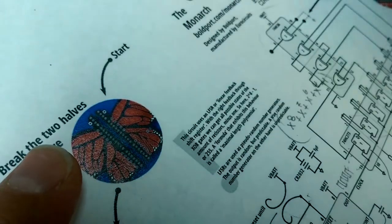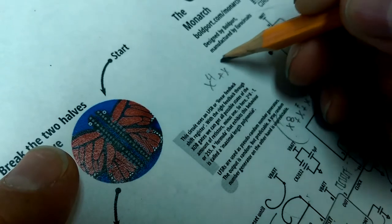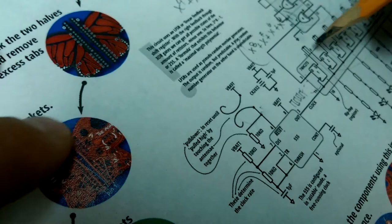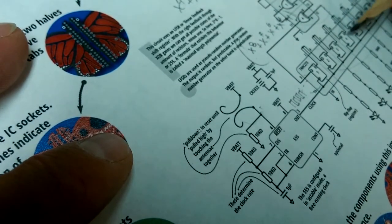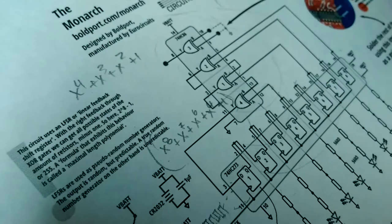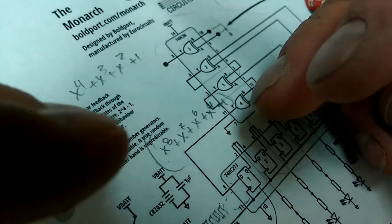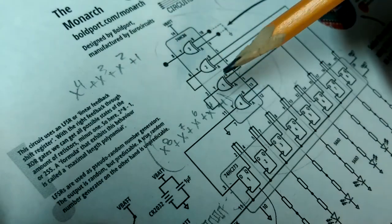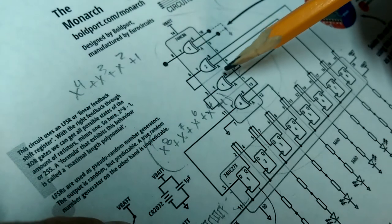So for example, if you wanted to tap x to the 4th plus x cubed plus x squared plus 1, then you would tap the 4th, 3rd, and 2nd bit. So what is that? That's the 4th, 3rd, and 2nd bit along there, and that would give you a different bit sequence, and that bit sequence would have a cycle, so it would repeat itself over and over again,